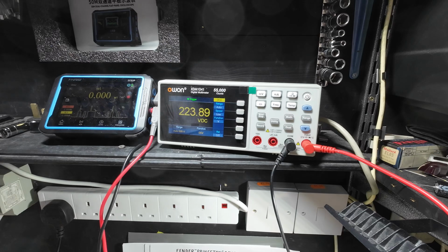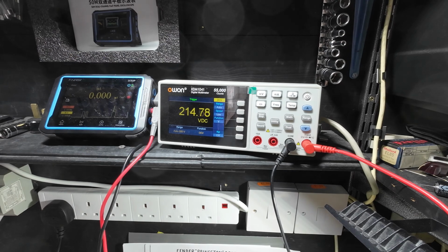Yes, that's boosting things up. Pilot light is lit. 214 volts, and you can see now the tubes are drawing current. That's beginning to fall. Don't hear anything out of the speaker. You've got the volume turned up. I don't hear anything coming out of there. But there could be many more plank moments. Drawing 110 milliamps, the bulb's dim. 150, we've got what, 75 volts going in there. Tubes are still cold. Maybe we just need another bulb.